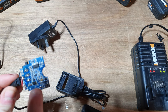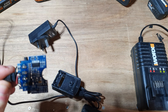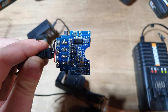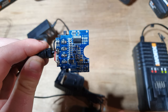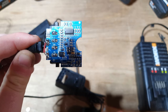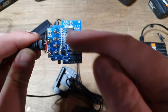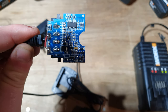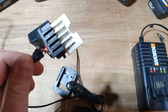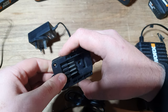The power comes in this side, goes through these multiple surface-mounted diodes, goes through the little brain chipset which basically senses it. This is available on all of the various different chipboard sets and pretty much does a protocol handshake — it checks how much voltage you've got and what temperature you're at currently, and monitors that from there. That's what the T is there for. You've got battery negative, battery positive, and battery cell individual. On the other side it's a single-sided board, so we have nothing but the connectors.